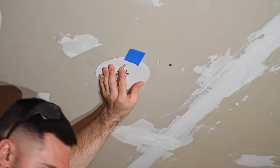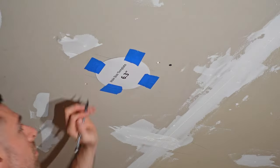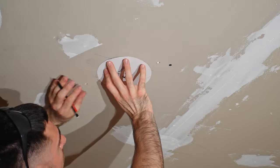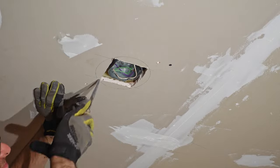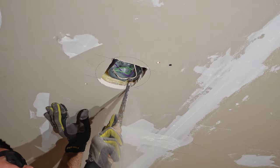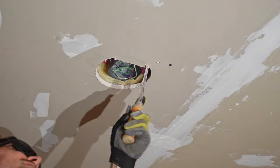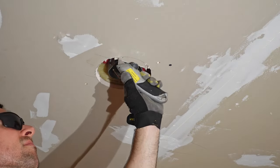Next up I'm going to use the template provided to mark the hole I need to cut for the light. I push all the wires back up above the drywall, tape the template to the ceiling initially to mark around it so it doesn't move, then remove the tape, line it back up with my original marks, and finish the circle. I'm going to use my keyhole saw and a utility blade to cut out the drywall — it's a cheap tool and it does the job just fine. This would be my seventh light cut out this way with no issues, but if you have a dedicated six-inch hole saw, feel free to use that.